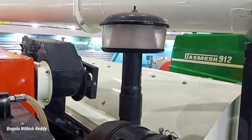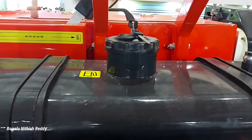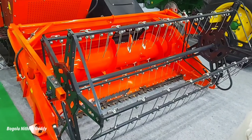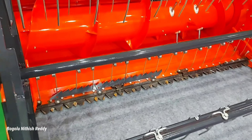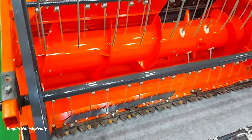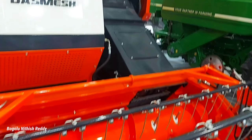The air cleaner is also a pre-cleaner. There is no dust fan in this harvester. There is no operator fan in this harvester. It has an adjustable seat — an updated adjustable seat. The cutter bar is 6480. There is a double blade shift. There is no springer. This cutter bar is SS-done — SS sheet is stainless steel material.